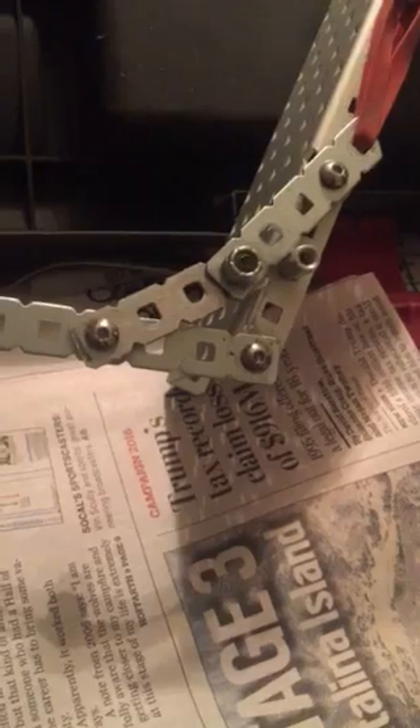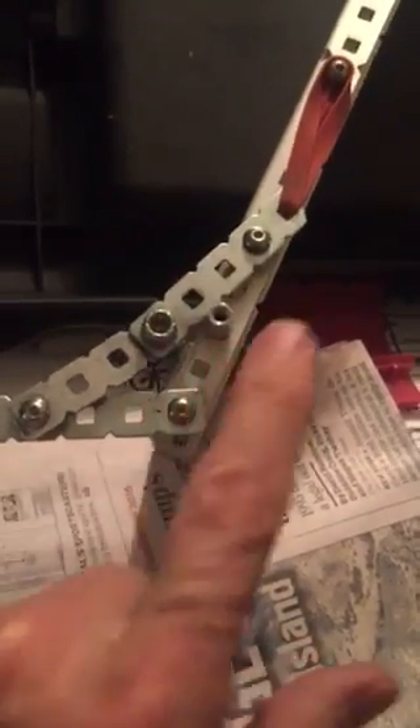And as a result, if I put pressure on the foot in the up direction now, this thing will only go to the stop. It will not rotate any further. Now, how do we ensure that this little linkage always goes to the stop? Well, we put this rubber band here, which creates a little bit of torsion in the counterclockwise direction of this link.